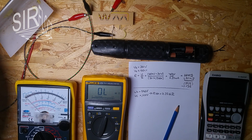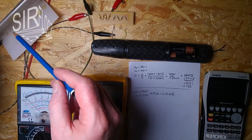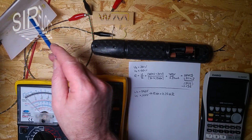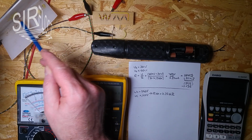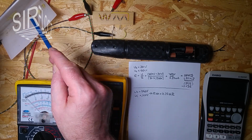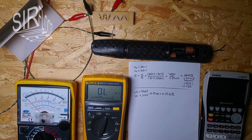It's just, yeah, the dirt does not cause an isolation issue by itself, but maybe the mechanism behind it in nature is that humidity builds up inside that dirt, and the dirt keeps the moisture there for a longer time. And yeah, the dirt combined with humidity, that's what's giving a lower resistance. So I may try to make it wet just a bit. Just let me try that.